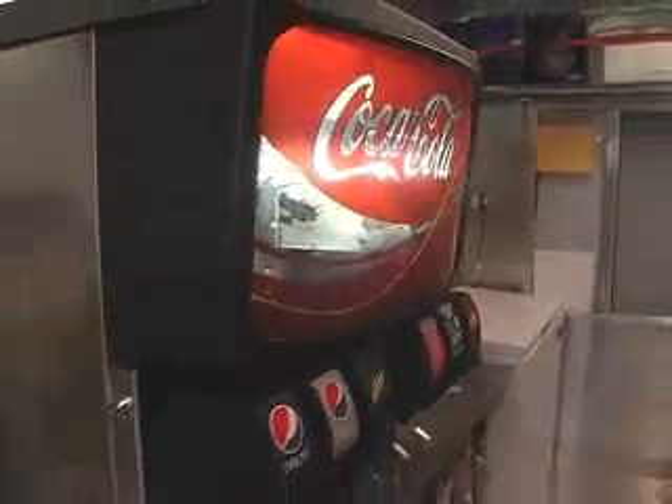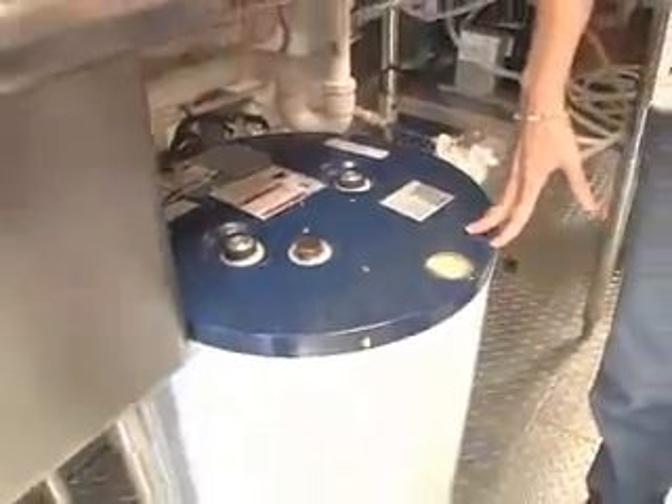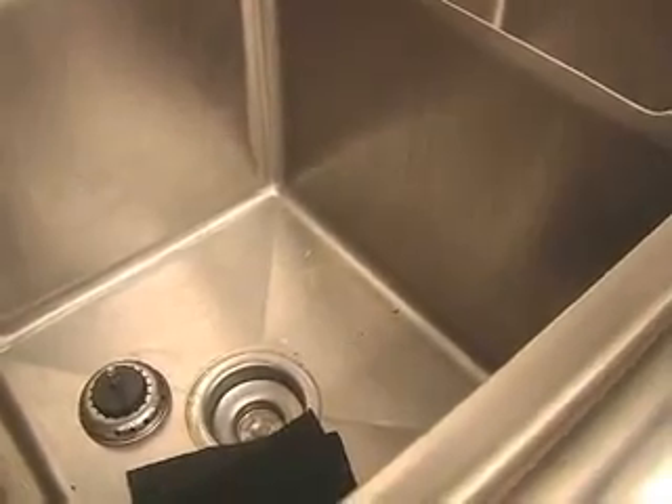Please keep in mind when sizing your generator that you must have enough power to run all this equipment, including lighting, the pump for the water, the hot water heater, the refrigeration, the freezer, the air conditioning, as well as any other equipment that runs on electricity. This is one of the most common things I see undersized on a mobile food unit. If the hot water heater is not of adequate capacity, it will not fill up the entire vat with hot water for washing utensils and will need to be replaced with a larger unit.